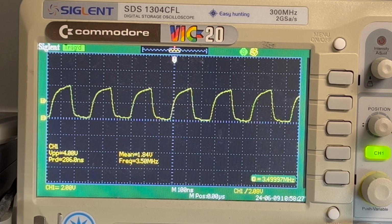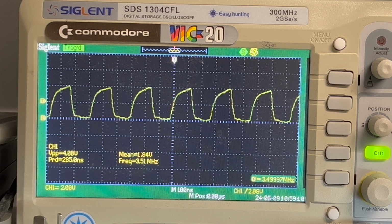I remember when I was looking yesterday, it seemed that we probably needed about 4.3 volts into the Z80. So if I change the amplitude of the input sine, it's 4 volts, 4.1 volts, 4.2, 4.3, 4.4. The signal reaching the Z80 is still only about 4 volts. So that's 4.6 volts, 4.7. I thought that was interesting. We're at 4.8 volts, but we're still not getting anywhere near the 4.3 that we need to actually trigger something.